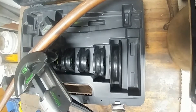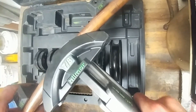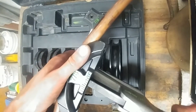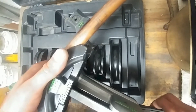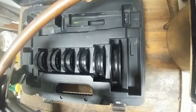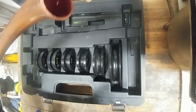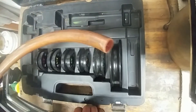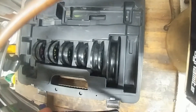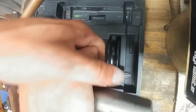I wouldn't trade it for anything else, so I would recommend it. My hand's a bit tired from bending. You can definitely see some ripple in this 7/8" piece — still not too bad. That's a piece of 7/8" there. What I wanted to show you earlier: if you want to pull this die off but it's free to move, you use this green lever — push down on it and it locks in place so you're able to pull this out. I don't really care for that design, so I normally just hold the shaft and pull it out. It's kind of hard getting your fingers in there.